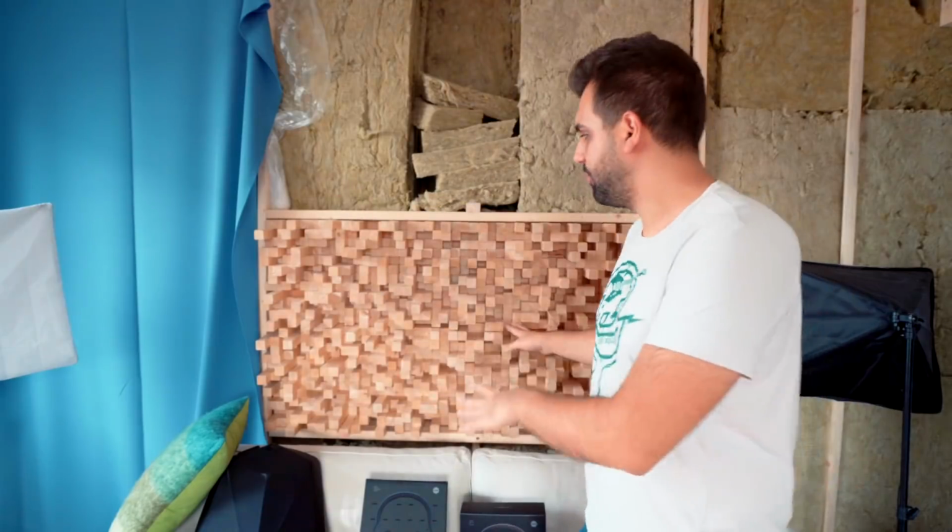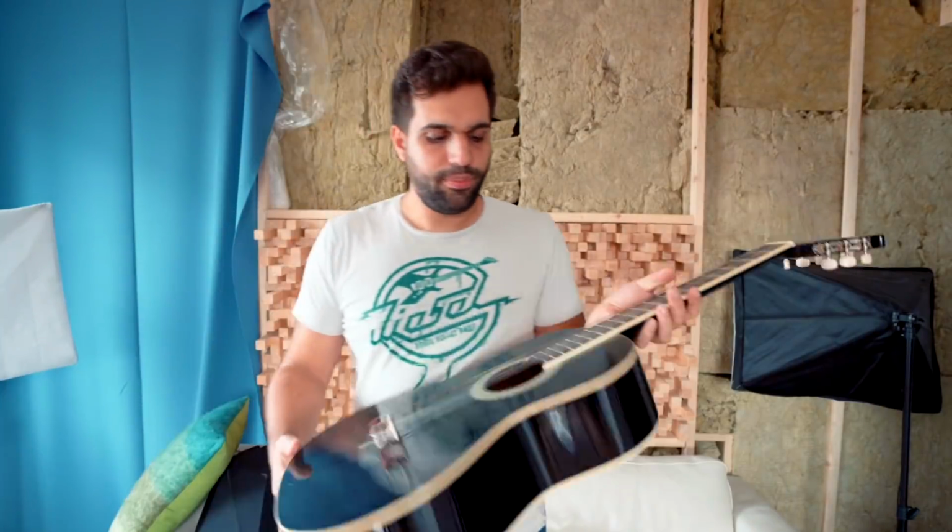Again, here we've got another one of those walls. This one is special, it has a diffuser in it. That's already like the professor stuff. It doesn't absorb the voice, it doesn't absorb the sound of the speakers. It reflects it, but in a diffused way, so that you get a little bit of reverb, because no reverb is also weird, but a controlled reverb that is nice and not bouncing and has no flutter echoes and these kinds of things. And that's really what a lot of people underestimate.